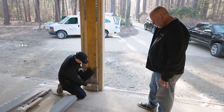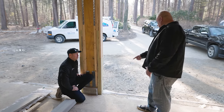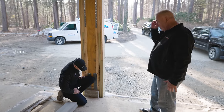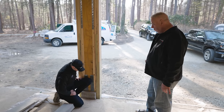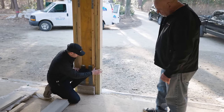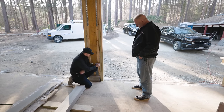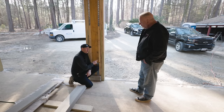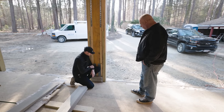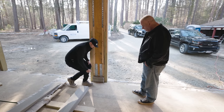That section there — it's just part of the wall where they cut part of it out, essentially a foundation wall. So we're eight-six from here to the other side. That gives you room to frame with two two-bys. Hal Custom Homes is using pressure-treated here, which is smart because this area is lower than the concrete and more susceptible to rot.